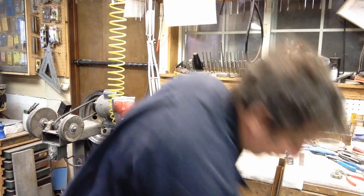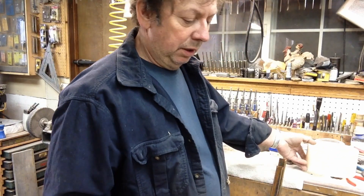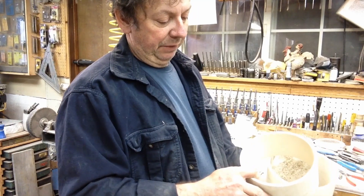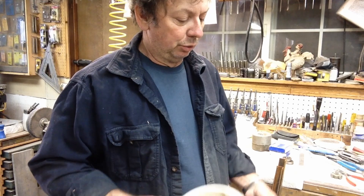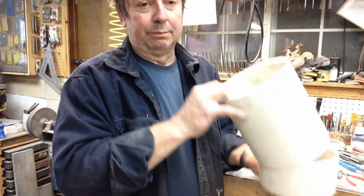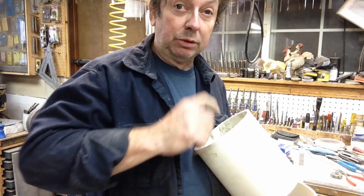I've got more pieces than this — pretty much a full length. It's fairly heavy wall, looks like about a quarter-inch wall. We're going to use this for the housing on the outside, and to feed it in we're going to notch it and take another longer piece. We'll probably thermally form it a bit to give us a little feed chute type of thing off one side. We'll cut out part of this on the sides and form it to the outside of the upright, have them join there so everything matches up with no gaps.